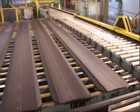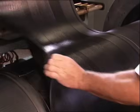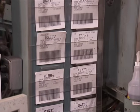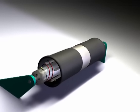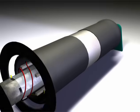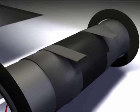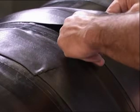Up to now, we've been making parts that will be assembled into the actual tire. A person called a tire builder assembles these parts using a tire assembly machine — the heart of the tire manufacturing process. Every component is identified and tracked using barcodes, and specifications in computers at each building machine make sure only the right components get used. We'll use animation to simplify and slow down the process. Basically, the parts are laid out on the surface of a big drum. We begin with the wire bands that form the beads, then sidewalls go on, the inner liner is added, followed by the chafers and body ply. Each component has to be matched end for end and spliced together.